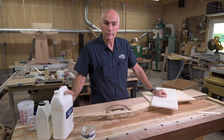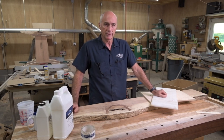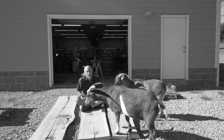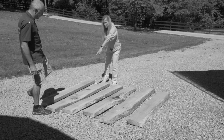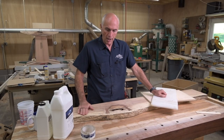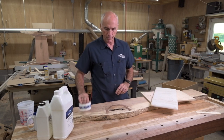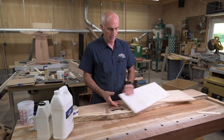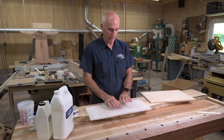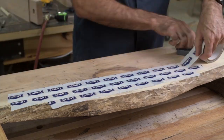The thick-set epoxy showed up in the mail today. I thought I said there wasn't going to be a lot of epoxy in this table — well, I got overridden. This is the top of the table, so I'm going to cover it with house wrap tape, and then just to support the tape and keep it from giving away, I'm going to put a dense foam on it. I'll put a piece of wood on top of that and clamp it in place — hopefully that will keep it from leaking.